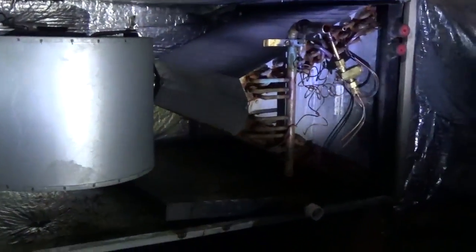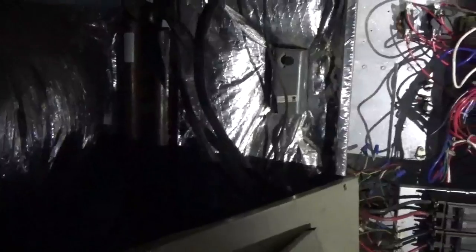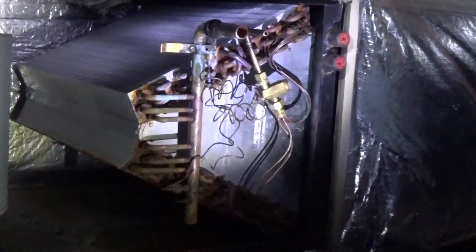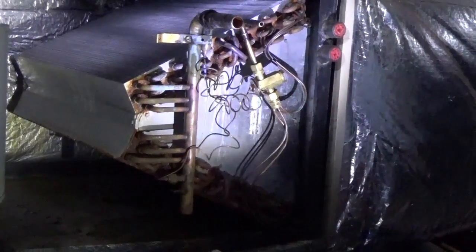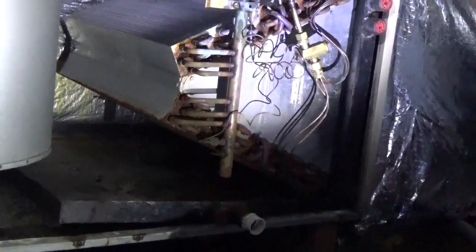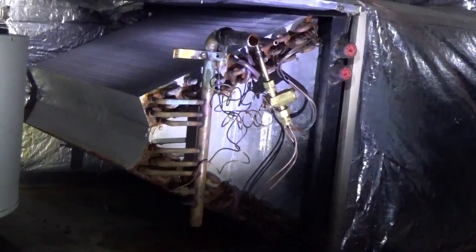We're getting the R22 out of here and replacing the A-coil with a water coil in my existing air handler. I didn't want to do a new air handler because I've already got my wood boiler coil in here. The four-pipe chiller will tie into my heat side and the cold side, and we'll control the cooling by running a thermostat to a bypass valve mounted on the new coil. First we've got to get this one out, the new one in, make sure the drain pan fits, and then block any holes around the coil so we don't bypass it with a return.